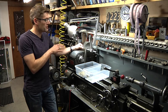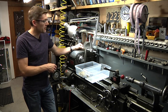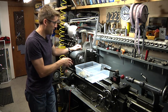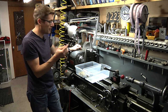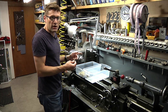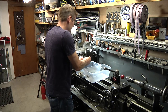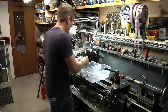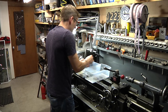We're done trimming the cases and have moved over to the metal lathe — a nice 1955 Logan 11 by 36 equipped with a collet system, which is very nice for this kind of work. We're going to do the rest of the machine-oriented case prep: first, ream out the primer pockets, then chamfer the inside and outside of the mouths of these cases. All I need to do is make sure I've got my cutter installed in the collet, then fold it in and do a nice ream on the primer pockets. It goes nice and quick, and with the horizontal axis the chips fall out nicely to the side. We can also choose the spindle speed to help things go faster.